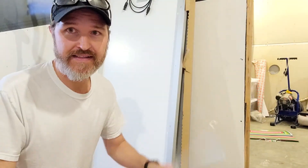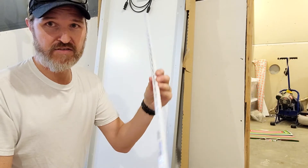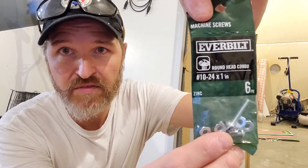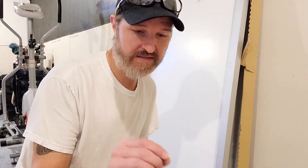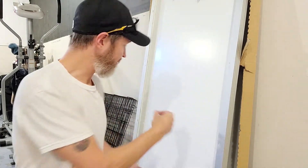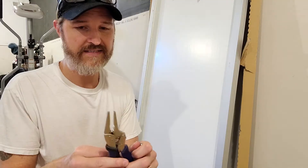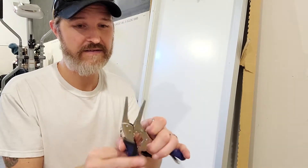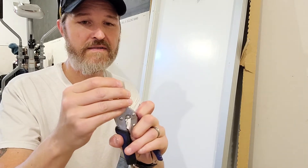We are back at the solar panel and now we're going to screw in this bracket onto the solar panel. I'm using number 10-24 thread 1-inch bolts, but I'm not using the regular nuts — I'm actually using lock nuts. So we get one bolt out, use a number 10 washer, and these number 10 lock nuts. I found the easiest way to hold the nuts on the back side of the solar panel is with a locking vise — lock pliers. Using these, you can adjust them right, put the bolt in, lock it down, and it's never going to fall off.